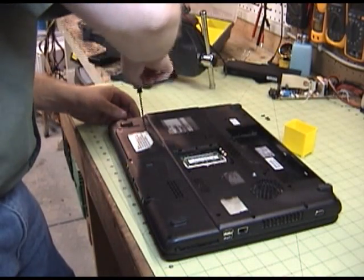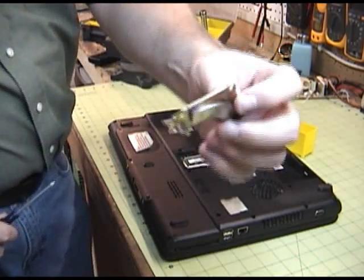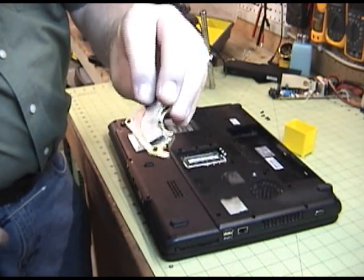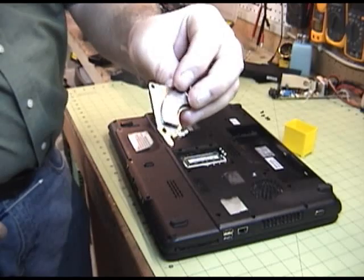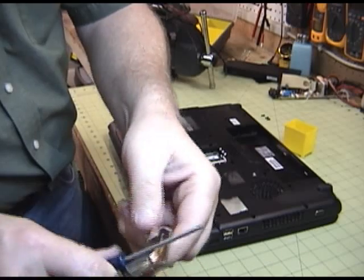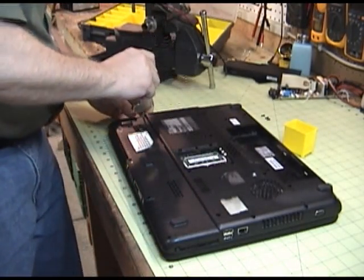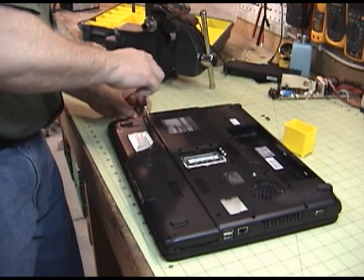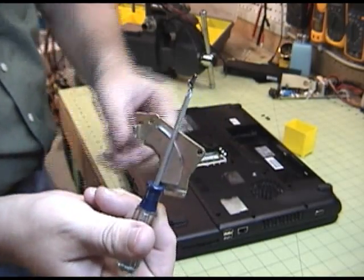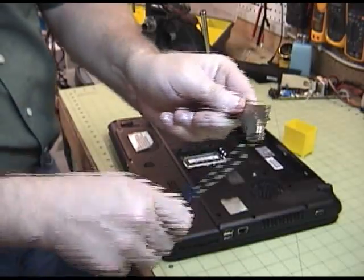This one doesn't want to come out. Sometimes you just can't get screws to come out even when they're loosened. This is a magnet out of a hard drive. So if you ever find an old computer hard drive, take it apart and pull these magnets out — they're extremely powerful magnets that come in handy. You rub the screwdriver on it to get it charged up, or sometimes you just leave it hooked on there. That'll give you a nice good charge and you can stick it down in there and pull out your screw. See, all that extra magnet strength pulled it right out where otherwise it was hanging up in there. Then you can charge it up again.